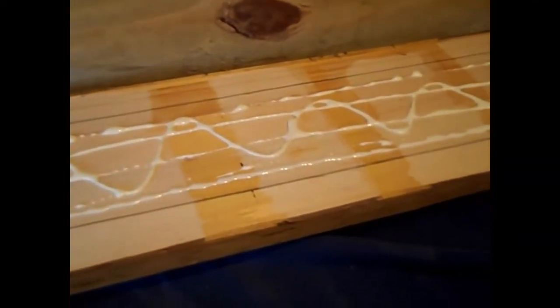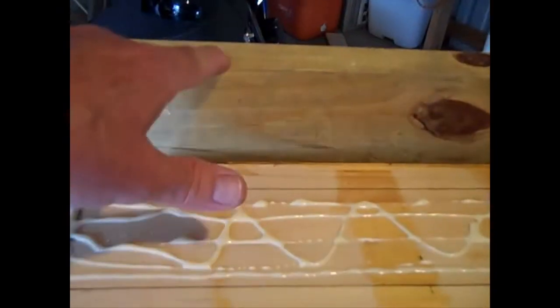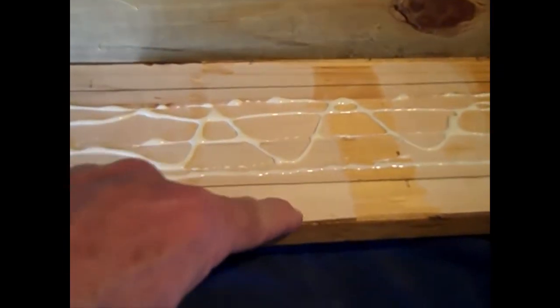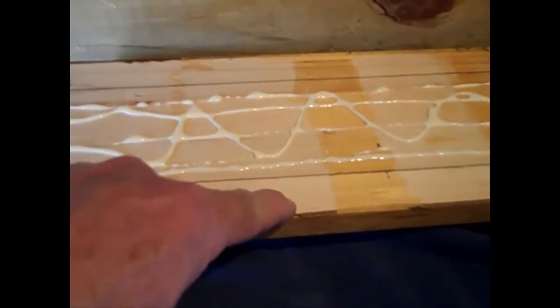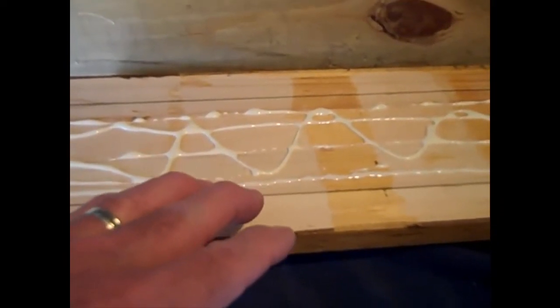So what I'm going to do is glue the 2x4 inside and then shoot a screw from all the way from the inside board that I'm going to put on the inside of the door, through the 2x4 and into this, almost all the way through it, where like I say, it'll be not only screwed but glued. So anyway, that's what I'm doing right now.